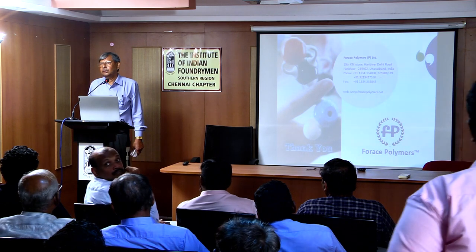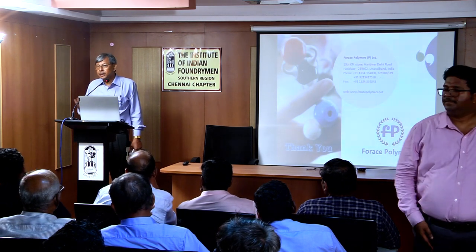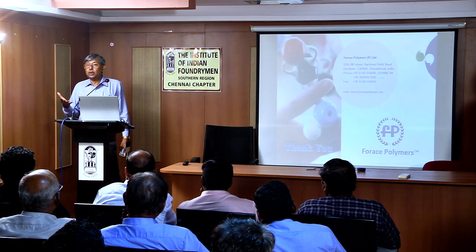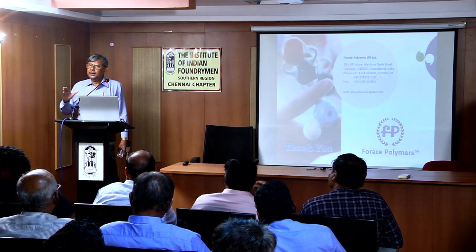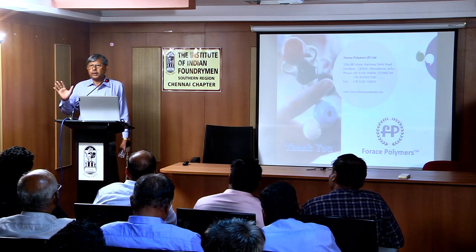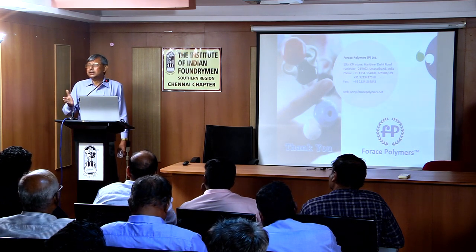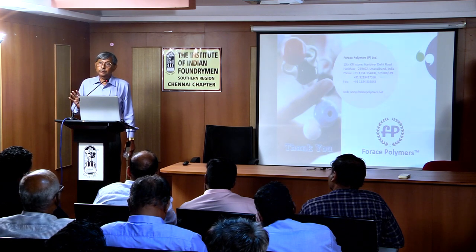Okay, sir, we are getting reclamation sand. So what is the recommended resin binder addition level, sir? Reclamation from where? Cold box reclaim or other reclaims? Cold box sand. We are not using it fully, in the ratio 4:1. But the quality of the reclaim sand first depends on loss on ignition. If it contains dead binders, it will cause a lot of problems. But from which industry is it coming? Only from cold box cores, thermal. Thermal means it will be reduced, it can be as low as 0.75%. But the quality of reclamation should be good. Okay, it is a thermal process.